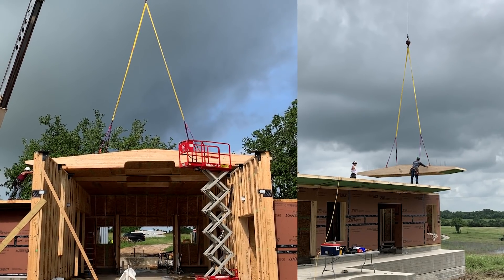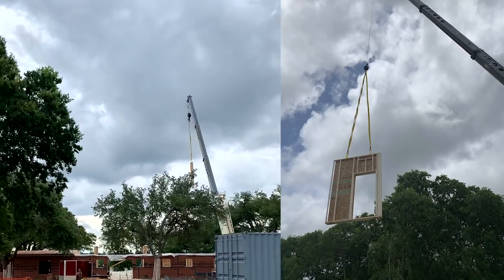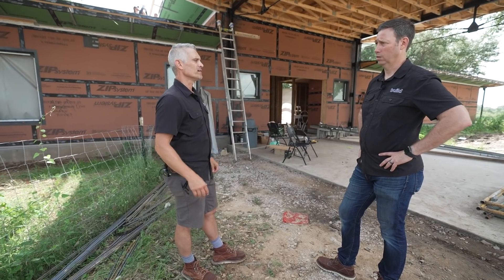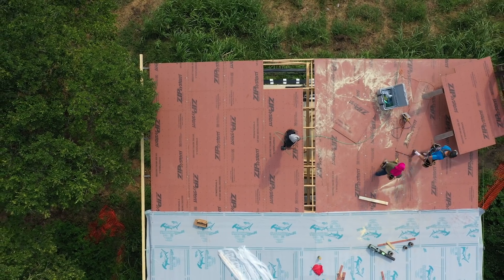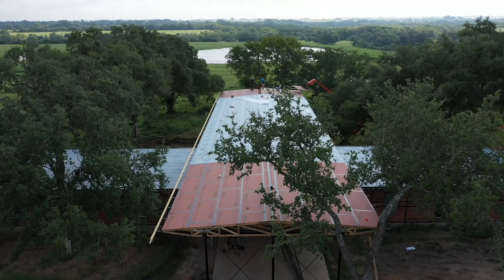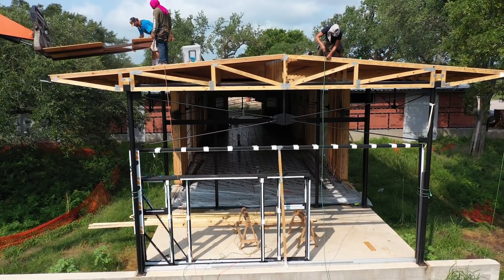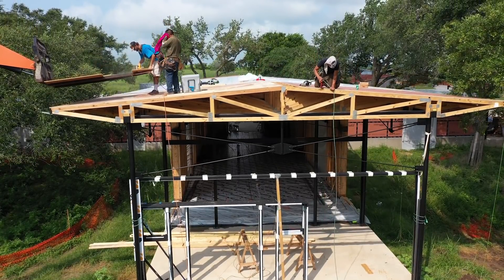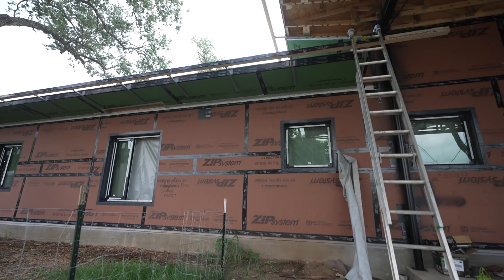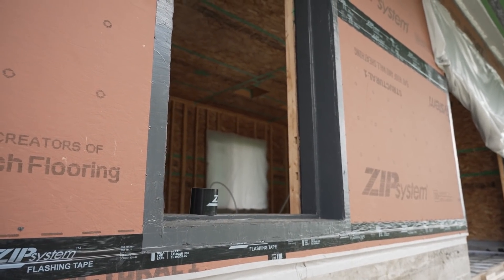That's a lot. And then how about the roof system? The roof system is also dense-pack cellulose. The panels come in eight-foot-wide sections, and there are glulam structure beams that go across, with dense-pack cellulose in between. That roof is around R-50, though it varies a little depending on the roof panel, because we have this wedge-shaped design that Lake Flato came up with. It has a flat bottom that tapers out to the eaves. Now when you look at this from the outside, it looks like it could be a perfect wall house — everything fully taped from the foundation all the way to the rooftop and back down again.